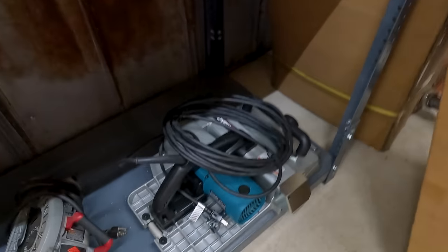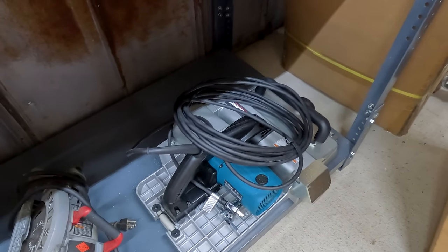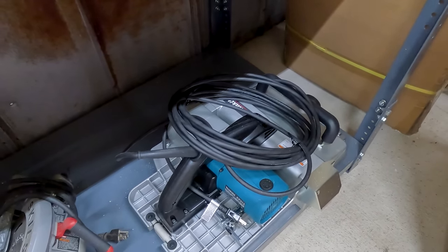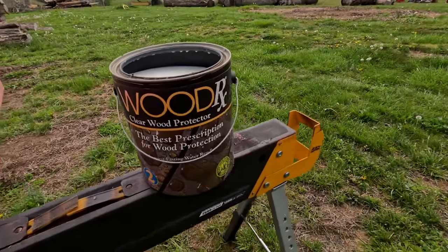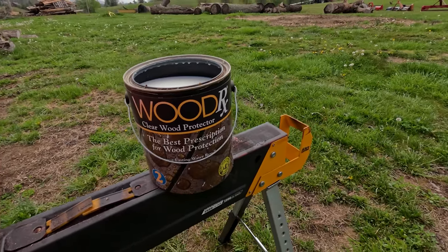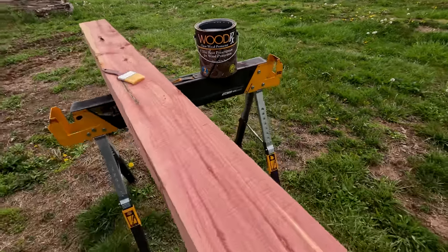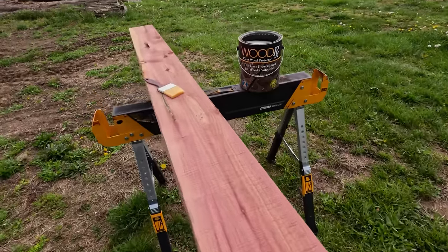Look over the mess here in the wood shop — right there is the new tool. That's a Makita 12-inch handheld power planer. I bought that last December and we will be using that a lot on some upcoming builds here on the farm this year. Now we're going to put a clear coat sealer over this post. This is made by Wood RX — this is not sponsored by them, I bought this with my own money. A lot of guys use this stuff and they say if you reapply it every two to three years, it will make your cedar always keep that nice color and the UV rays won't affect it. I'll report back here in about six months and see how it's doing.